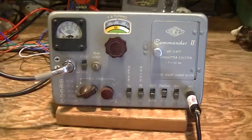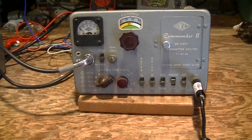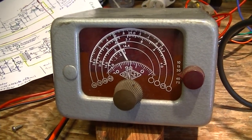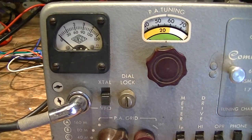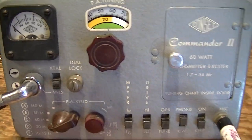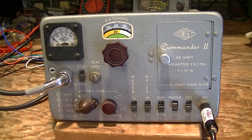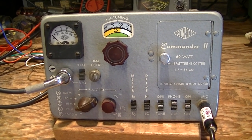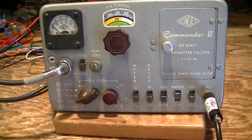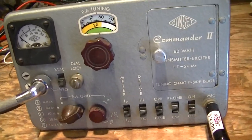A very diminutive AM/CW mobile transmitter, used with the matching passive Gonset VFO. This screws onto a connector in the front and turns a crystal oscillator into a Colpitts VFO oscillator, and it works very well. This transmitter has been on my bucket list for more than 30 years. My good friend Eddie K6ZMI set it aside for me a long time ago, and finally it came to live with me, so I'm going to be its curator until I shuffle off the mortal coil.